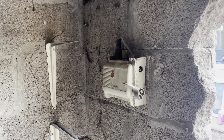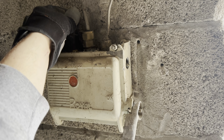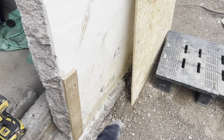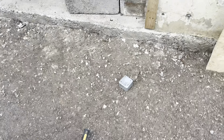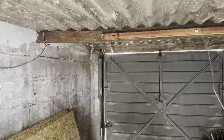As you can see, this board is absolutely ancient. Luckily there was no power to it. Found the other end of this SWA cable - it's a four core 2.5mm - that was just disconnected in the house. I've cut that out; it was coming down the wall here, out somewhere, and just across the floor - you can just see it sticking out of the ground there. It's disconnected at either end, but I'm just going to tape it up so nobody reconnects into it in the future. I'm just ripping out the existing lights in here.